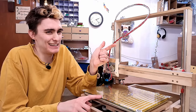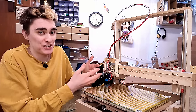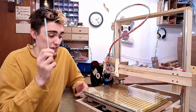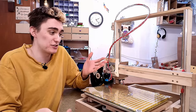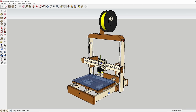I don't really like 3D printed gears in general, and making entire gear reduction from scratch seems like a lot of hassle compared to just slapping in threaded rod as a lead screw. Plus, to get down to a reasonable minimum resolution, both of those will make the printer equally slow, so I might as well pick the easier one. I already have those modifications sketched out in CAD.